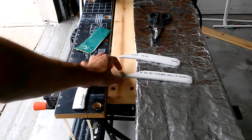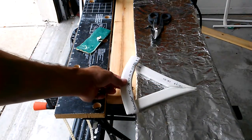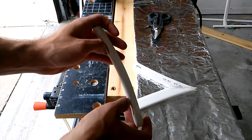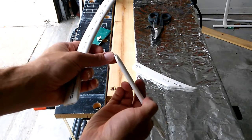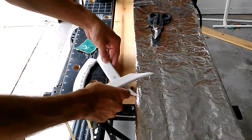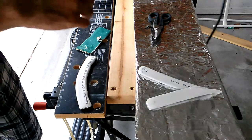Welcome back. Here we have the three components for the blade of the Assassin's Creed style tomahawk: the rear portions that form the legs of the A, and then the blade itself. I've gone ahead and cut slots, starting off with the X-Acto knife, then widened them a little with a file and sandpaper. Now we're going to heat them, and having tapered these pieces, we're going to try and force them in. We may need some adjustments, but we're going to force them in and ultimately glue all three pieces together.